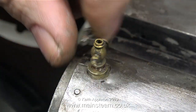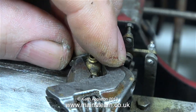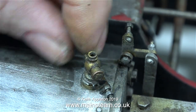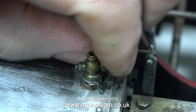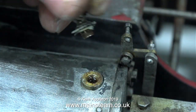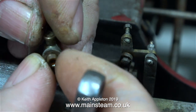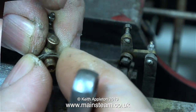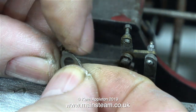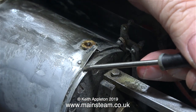The drain cocks are fitted into bushes, which in turn are screwed into the cylinder. On this drain cock there are some very rough looking pieces of metal functioning as shim washers. I'm going to discard these and fit proper copper shim washers, which will allow the new drain cocks to be set to exactly the same angle as the linkage. I don't know why people do this — this is just a couple of scrap pieces of metal. There's a phrase that sums it up: spoiling the job for a ha'p'orth of tar.